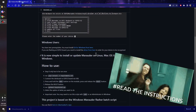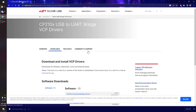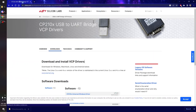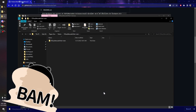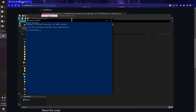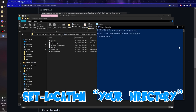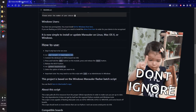We're going to scroll down here and get some information about how to install this. You're going to have to install Git for Windows, which is pretty easy — there are instructions right here. You're also going to need the driver for the ESP32. Just go down, click on the universal driver, download and install it. So we're going to go back to the repo, open our zip file, extract it, and open the folder destination. Copy the path and hop over into PowerShell. Go to the folder location using Set-Location with the path. Now we're in there so we can start following the instructions.